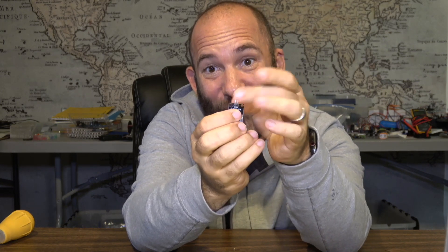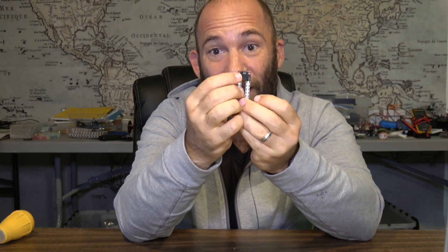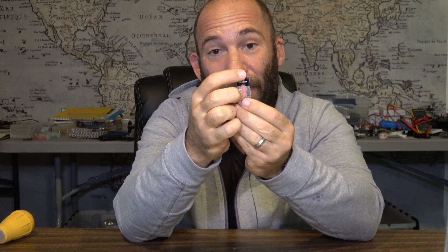If you're going to use this in a real production environment, I'd recommend something called liquid electrical tape. Once you've made all the connections, shellac the top part — the solder points and wire connections — with liquid electrical tape. Because remember, the sensor is measuring resistance between two sides, and if water shorts those connections higher up on the board or wires, you'll start getting readings that indicate moisture when there may be none. For real-world deployment, keep those connections protected.